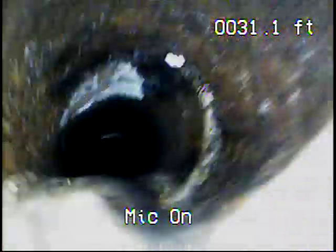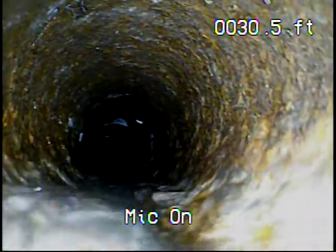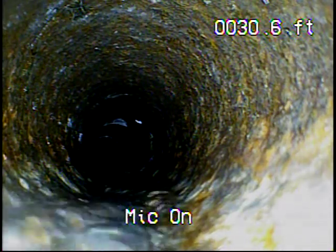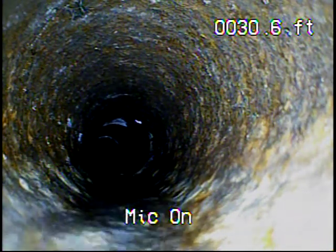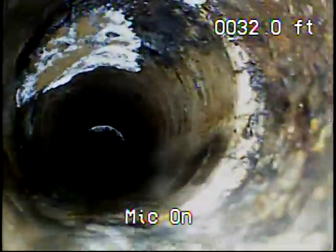I mean, that's very little rusting for the water level here. So this line right here is going to be the water level line. Which means they're running 3 or 4 or 5 fixtures at a time. It's as high as it gets. Everything above that's never being used. Great news. Okay. This transition is going to be the first point I like to look at very carefully.